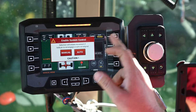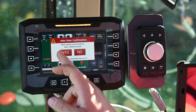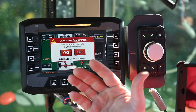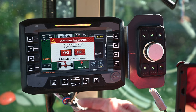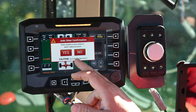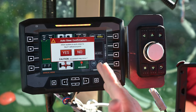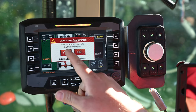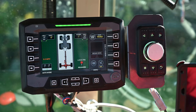To engage auto mode, go ahead and press auto. There will be another pop-up asking you if you can steer the axle, if the axle is safe to steer. We're parked in a straight line right now so I'm very confident in hitting yes, but I always do a visual check to make sure that axle isn't going to steer and hit something. So we hit yes, the axle is going to steer, and we're in full auto mode in road mode.